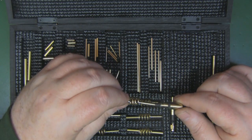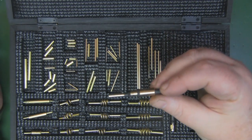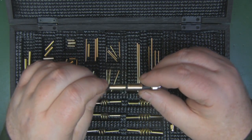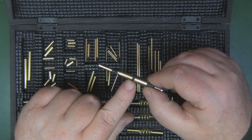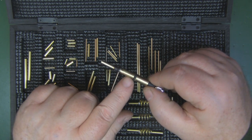So playing with this development kit then, I have learnt quite a lot of information on how one of these short bottom fed dipole antennas do work. I previously didn't think that the ground plane on this made the majority of the distance when selecting the centre frequency that you wanted it to work at.